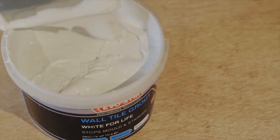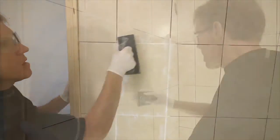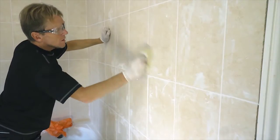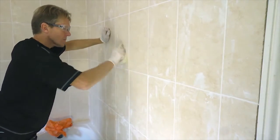When the tile adhesive is dry you can apply the grout. This provides the first line of defense against water ingress, so it needs to be pressed firmly in with a grout float to fill any air pockets. If you're using a ready-mixed grout you'll find that it flows in very nicely, but you must remove the residue with a damp cloth as you go — once it's dry it will take many hours of scraping to remove.